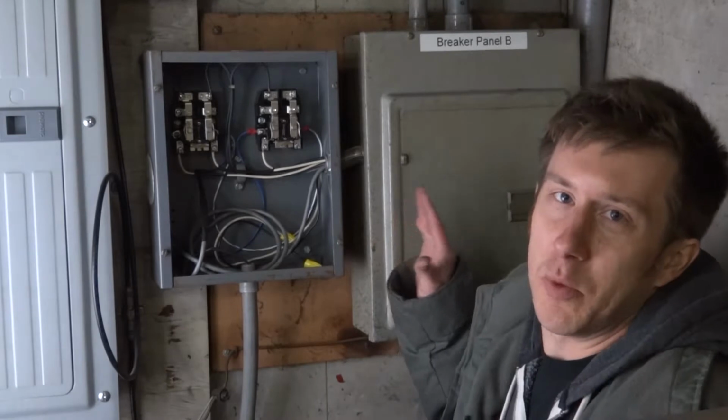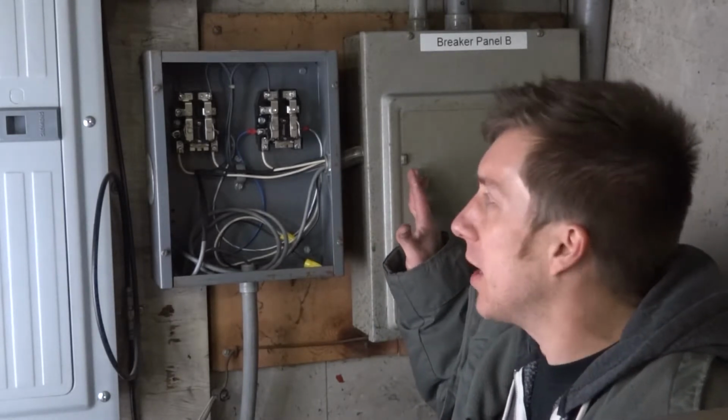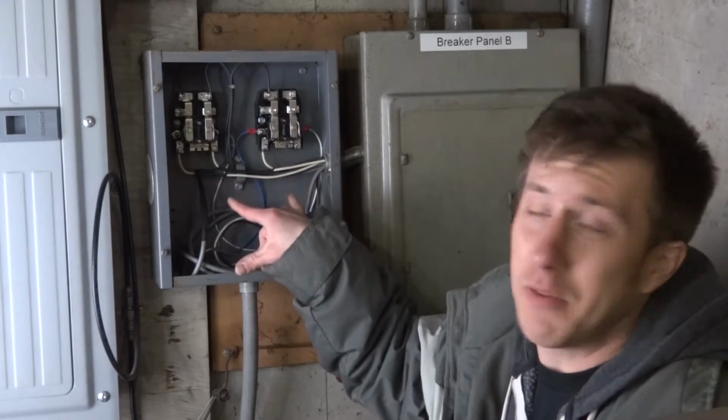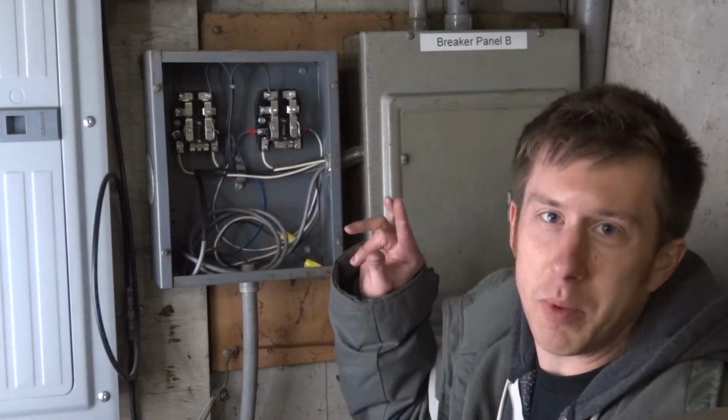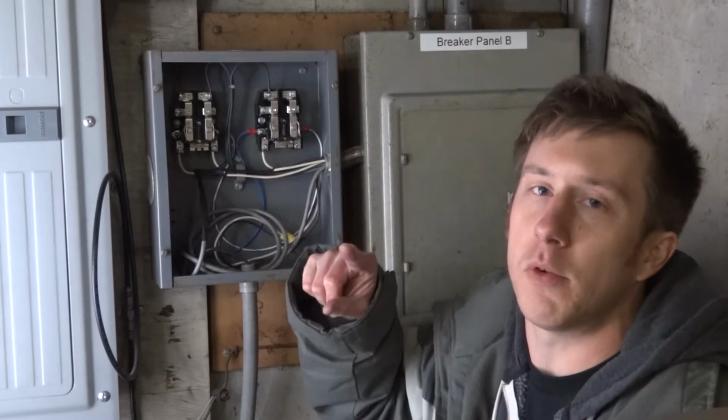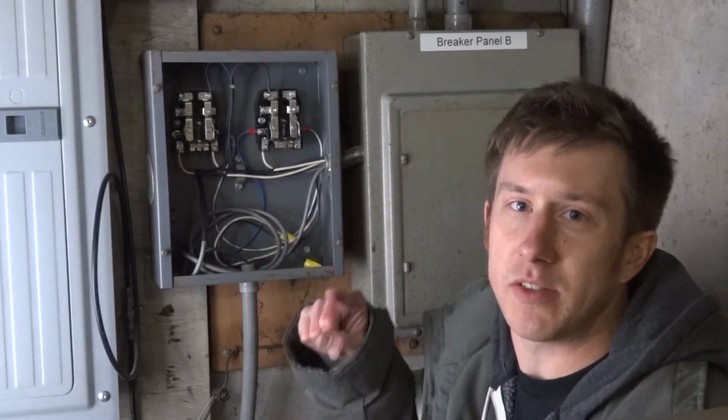And essentially, the way that it works is it comes out of the breaker box, goes through these two big relays, or baby contactors, or whatever you want to call them, and goes out to all the baseboards in the shop. These are the two big relays that are controlled by that 24 volt AC relay inside that's interlocked with our thermostat.